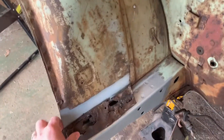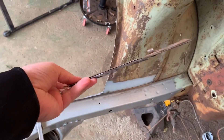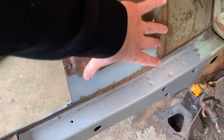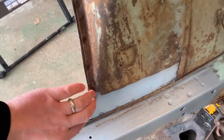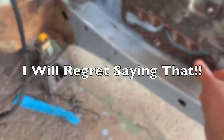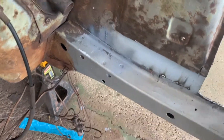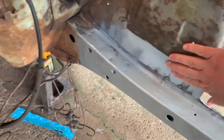It's not raining hard out, it's just a drizzle, but we're gonna go ahead and keep working on this part anyway. Let's take a look at the shock towers. This is the rusty part that I cut out — it has multiple layers. I've already placed this on the other side, so all I've got to do is actually just weld a piece in here to help strengthen it and support it. That's going to be pretty easy to do. I also have to do the same thing on this side. Man, it's had some big rust holes in it.